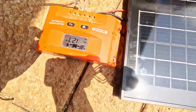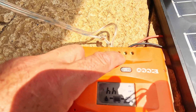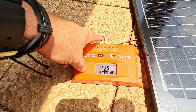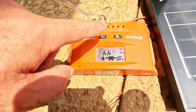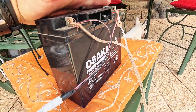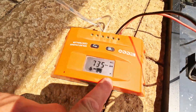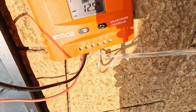As long as it's 12 volts — you're looking for 12 volts. From the solar panel there's a positive and a negative, and those wires go in where it says 'solar panel,' shown by the solar panel emblem. Positive is the red wire, black is negative. I've tried to make it as cheap as possible, so any wire works — just mark the positive clearly. You can see it's charging. At night there won't be any light so the solar panel won't work — it will show a little moon on the display, meaning it's now nighttime.